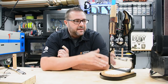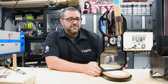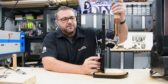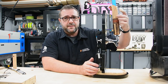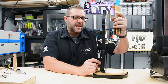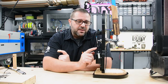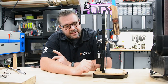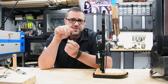Now that we have the base completed, the backplane assembled, and those things together, it was time to move on to some of the bigger challenges — one of which was the linear actuator and how I was going to set up the linkage so that I had sufficient axial give in case it was over-pouring, or maybe somebody just wants to pull it and pour their own beer without using the Force. I needed to come up with a linkage that had this ability to adjust and allow the user to override the system. This was all 3D printed and designed in Fusion 360, as well as the levers, the enclosure, and the little bearing race assembly. Let's go back into Fusion 360 and show you what this looks like.